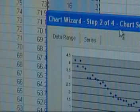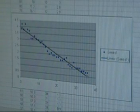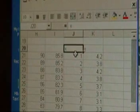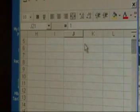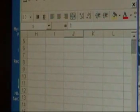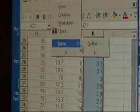I plot it on a line graph and it's pretty close — I could draw a straight line through it pretty easily. So I'll draw a straight line through it just for fun. I'll use that function to estimate the actual temperature versus what the digital thermometer is reading. First I need to name these regions x and y so I can easily type the formula in. This is an old version of Excel, but I know how to work it. I name those two regions x and y so I can then get the slope and intercept and make a formula.